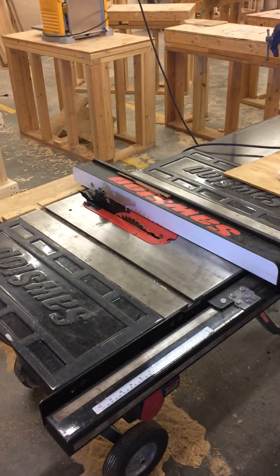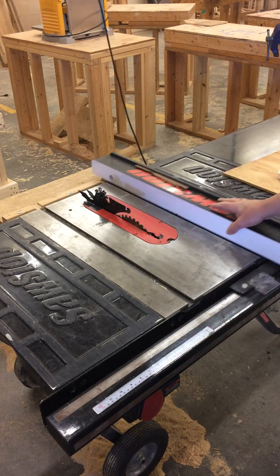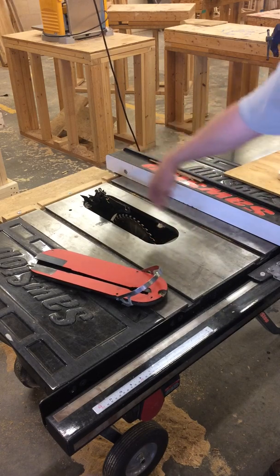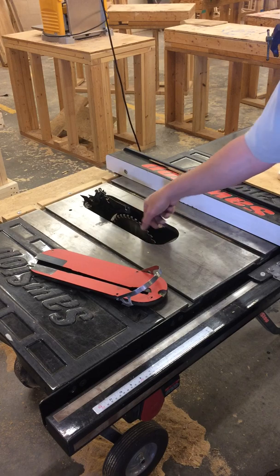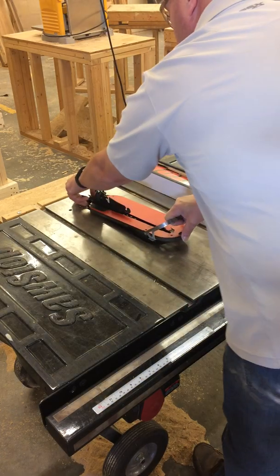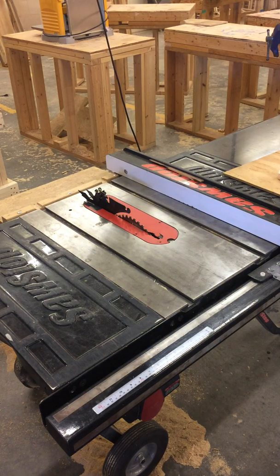I'm going to turn the master power off and unplug it. Now I'm ready for maintenance. Just like everything else, I'm going to make sure it's clean and dry. This thing collects a lot of sawdust — we have to blow these things off regularly, especially on the inside. I'm going to pull the guard up and clean all down in here with the air hose once it builds up. I'm also going to check the blade — I'm going to spin it toward me a little bit and look down the line of the blade to make sure it's not warped or bent out of alignment. That is how to use a table saw.